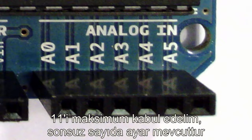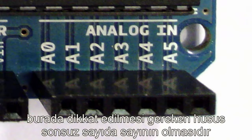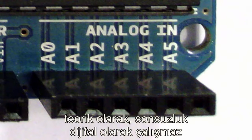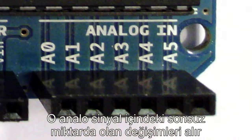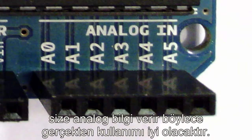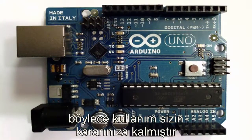That infinity does not work digitally — we need discrete steps to work digitally. What the analog-to-digital converter does is take that infinite variation in an analog signal and digitize it into small steps. A lot of sensors you'll use will give you analog information, so that's going to be really useful. It's also important to note that those analog pins can be used just like the digital pin headers, so it's your decision how you want to use them.